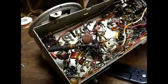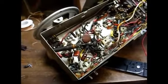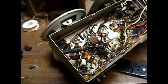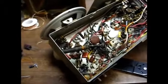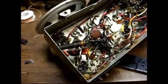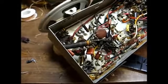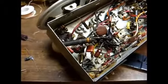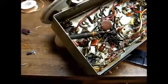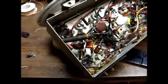Okay, the capacitor replacement is coming along nicely, and I'm about to replace the multi-section electrolytic can capacitor. Even though there was no hum, I decided just to do a spot check of the capacitor in the cathode bypass section for the output tube, which is rated at 25 microfarad, only reads something like 3 microfarad. And I learned a long time ago, the hard way, on these multi-section capacitors that if one section fails, it's usually not too long before the other ones go south.